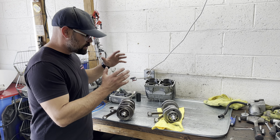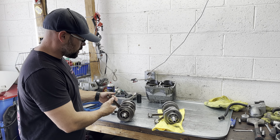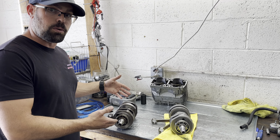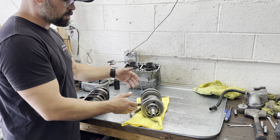The most important thing — we have two cranks here. This is a good used crank and this is a bad one. Visually you can see that this crank's taken a lot of salt water, a lot of years. You can see a color difference big time. The natural brown color you're seeing here is from corrosion from water making its way into the crank. On the other side, this is a pretty good crank — this one's been recently rebuilt.